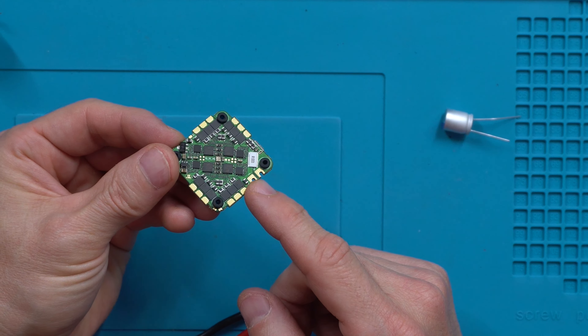We're going to do a few more things. This is the part that goes underneath the plate — we flip it over and this is where the motor wires connect. I'm going to tin up all of these and also add the LED and everything else so it's done. All tinned up now. For the LED wiring — the bottom long pad is five volt, the top long one is ground. Coming around the corner, the first pad is LED, and then there's T3 and R3. Their labels are hidden under the grommet, but if you pull it back it says LED there.